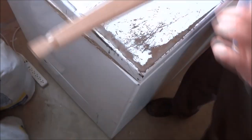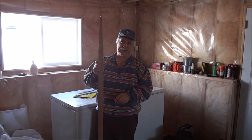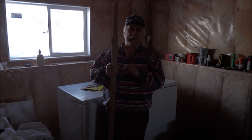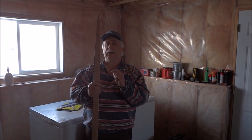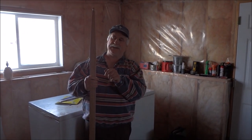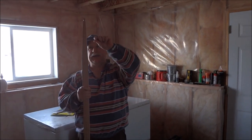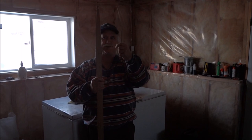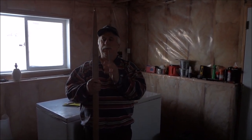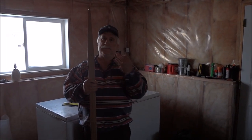This bow is red oak, 72 inches. I've had good luck with these board bows and I build them a little over-built, because it's better to have an over-built bow that doesn't fail you when a grizzly is standing in your face than to have one break on you. If you come down to 67 inches you'll gain more speed, but it starts to be a little more frangible.